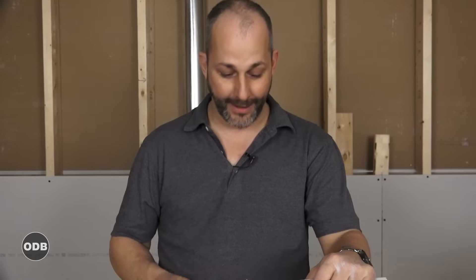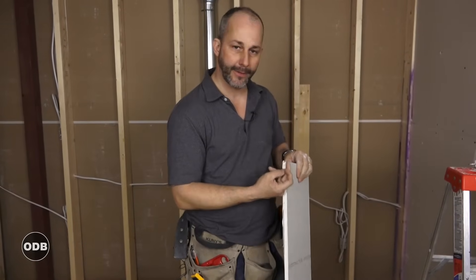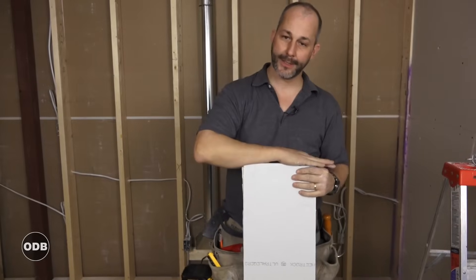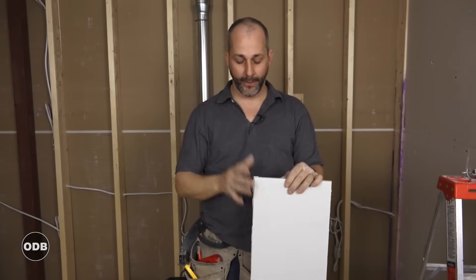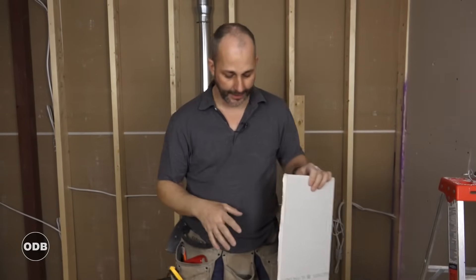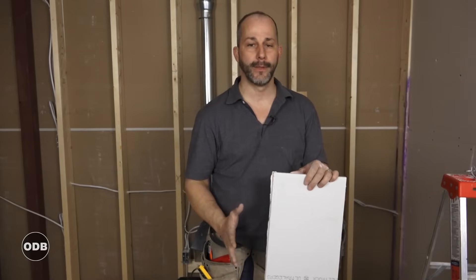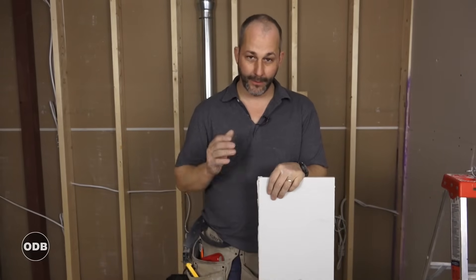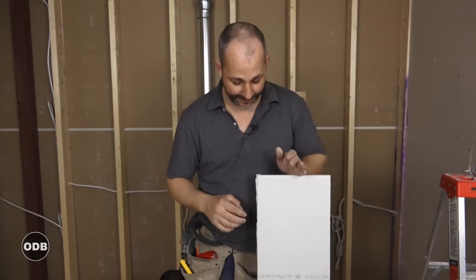This room is pretty small so we're going with all full sheets. This is three-eighths thick, this is half an inch. When you put two sheets together with the tapered edge you can tape that in only three steps. Drywall only comes in 8, 9, 10, or 12-foot lengths, so if the wall is longer than 12 feet you'll have a butt joint, which takes more skill to finish.